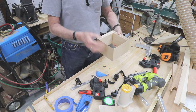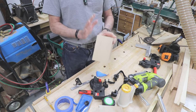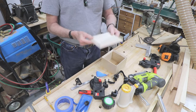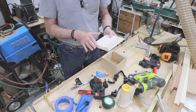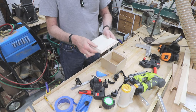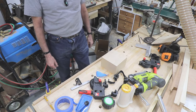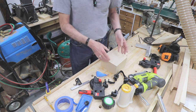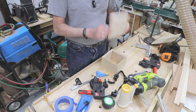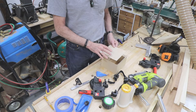It's square and ready to go. Got nice miters all the way around. I used the same process I used to cut the miters on the sides to cut the top — basically cutting the top to size close and then sneaking up on the miters till they fit. It just drops right in there and fits — that's about perfect. So all I need to do now is spread some glue around in here, place this down, put some pressure on it, and pin it in place. And I have finished one of the boxes.